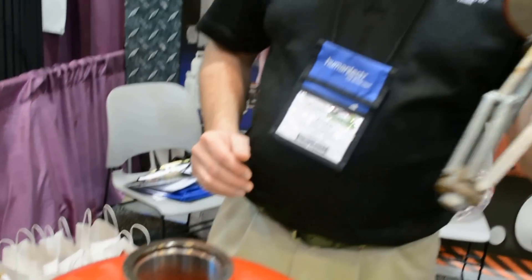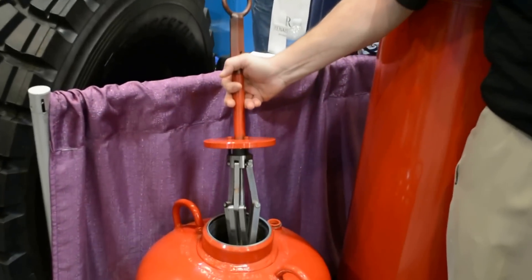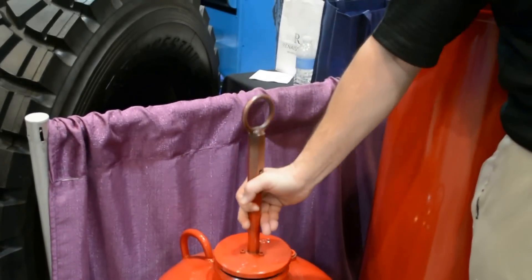The hanger design is good for a two-and-a-half inch coupling all the way up to a four-and-a-half inch coupling, so we didn't have to make multiple hanger designs to accommodate all of our tanks. An outside PE firm rated the hanger at 1,700 pounds. Our heaviest tank that goes through this process is right around 900 pounds.